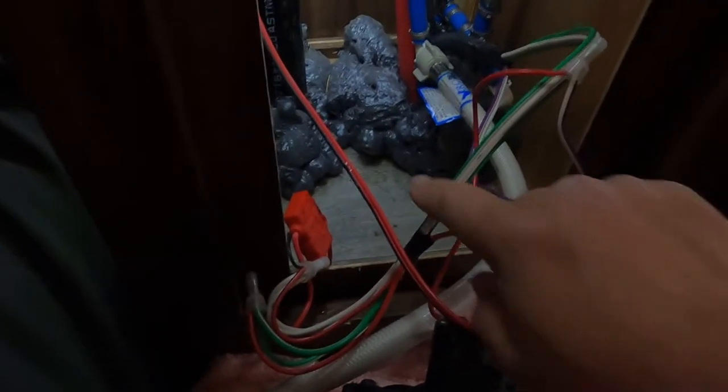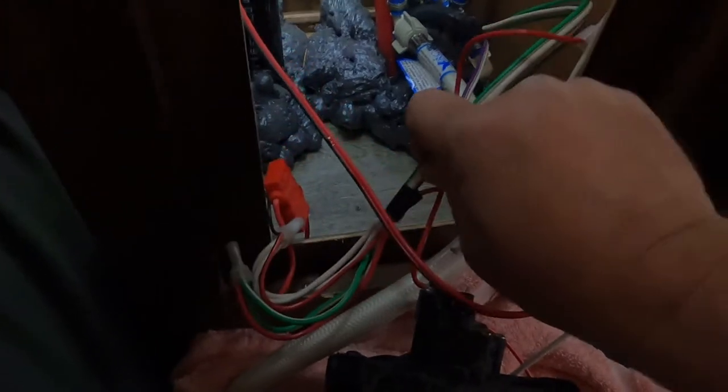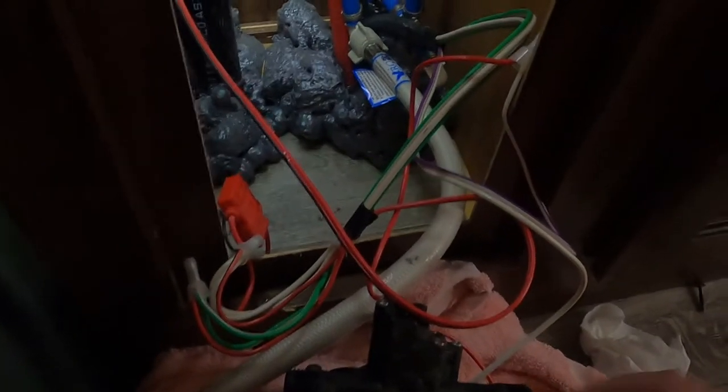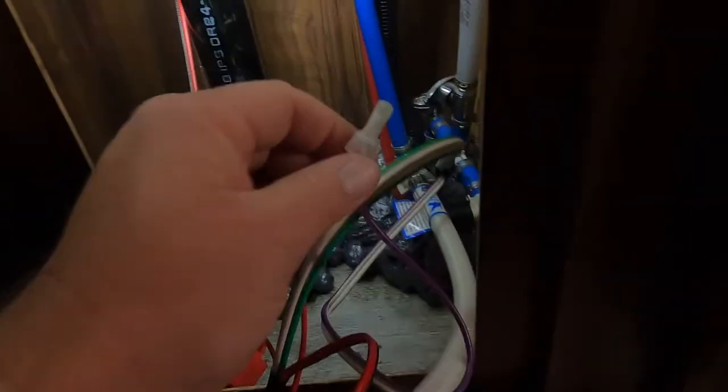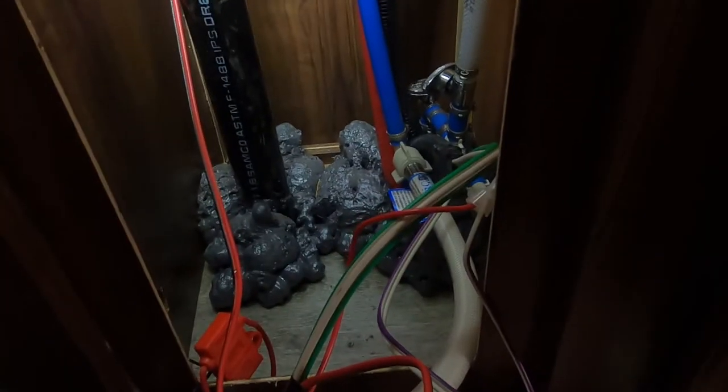As you can see, if you're like me, I was a little intimidated when I first opened this up and saw all these wires and thought I'm going to electrocute myself. But it's really not that complicated. We do have a lot of wires here because we have a CO detector and an outlet run through this panel. The wires coming from the battery come up through the floor here, and coming off the pump there is a power wire and a ground. All you have to do is undo these two wire nuts, wire your new pump in, and reinstall it. Don't let all this scare you.